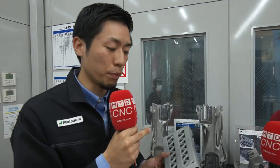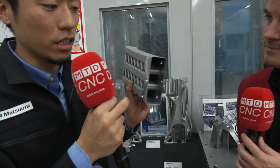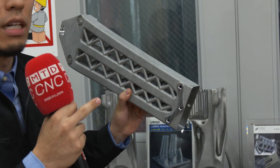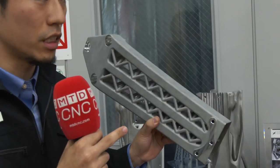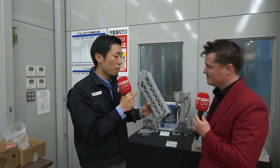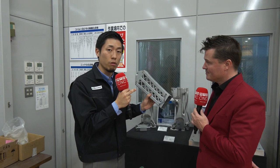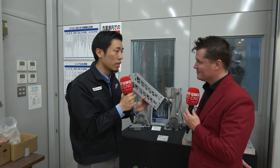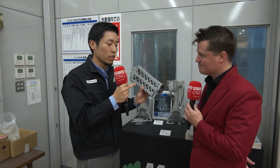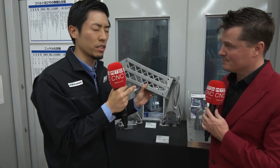What is unique about this part is the thickness — it's actually one millimeter. And of course it has an AM structure, so the great rigidity is there. Another unique point is we have some areas to do machining, post-process. But this part, of course, needs precision and accuracy. That's why we have a reference surface to locate the center — that's how we locate the exact area to machine so that we don't mess up the part.